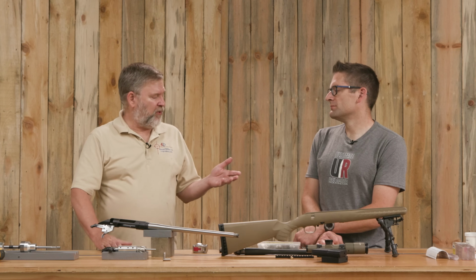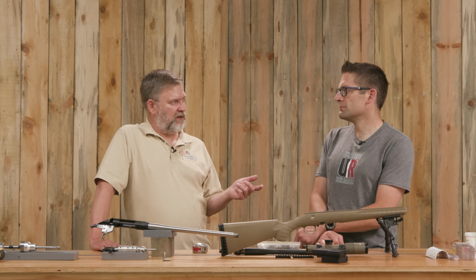At that point, we just go whatever the reamer will allow, and it usually ends up being 40 or 50 thousandths in a pass. If you go much more than that, you'll pack the reamer, which can cause it to cut oversize. It can cut grooves. The chips can get packed in and cause problems. So that's why you want to clear it frequently. And of course, lots of cutting fluid every time.